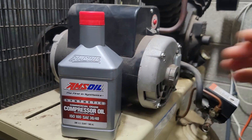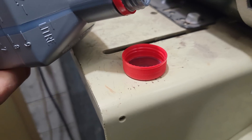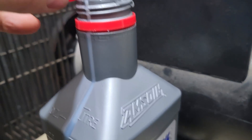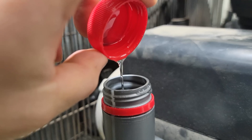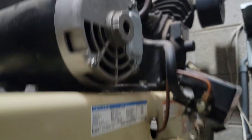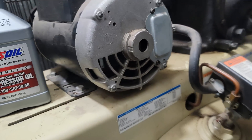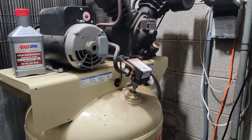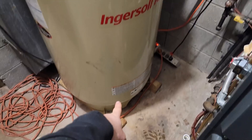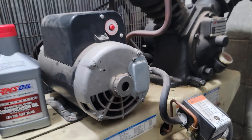Checking the oil viscosity — this is actually really good oil; not bad at all. There's no way it's thick enough to damage the motor; it looks perfectly fine. I think over time, these motors are cheaply made, and hot and cold cycles — especially cold — cause more draw on the compressor which could contribute to them blowing out. I've had this compressor about 13-14 years. The water drain on the bottom is frozen, but that's not a big deal.